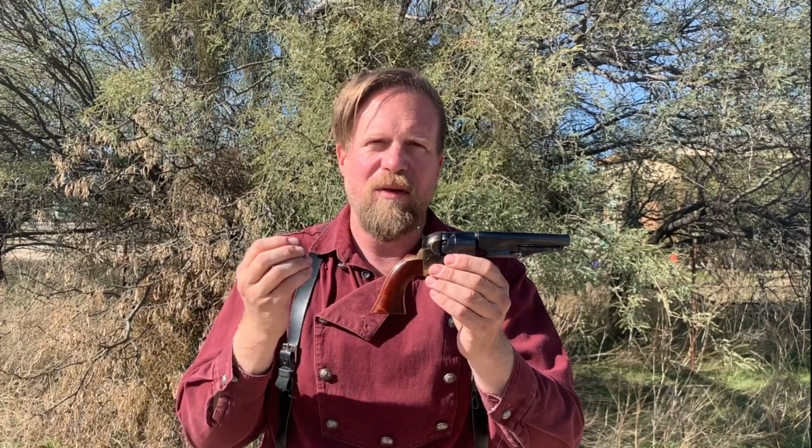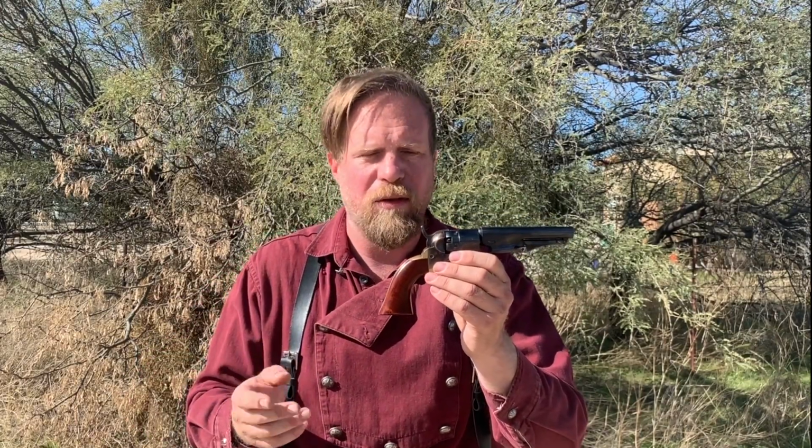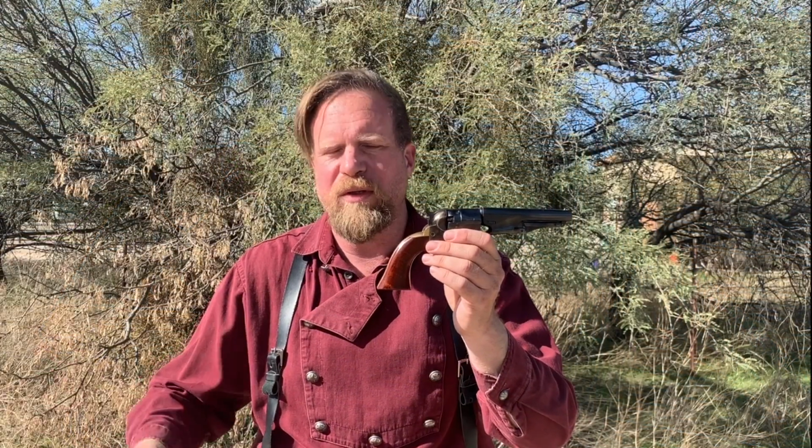And it's a testament to the Colt design, because a lot of the other revolvers at that time had a problem with black powder fouling. But the arbor inside of the Colt designs, all of them with the exception of the Patterson, have grease grooves in it that are designed to deal with the fouling. Kind of like tread in a tire, the fouling gets in those grooves, and it prevents the gun from seizing up. And it's one of the reasons the Colt was one of the most preferred revolvers of its time.